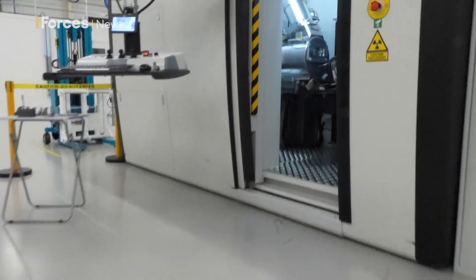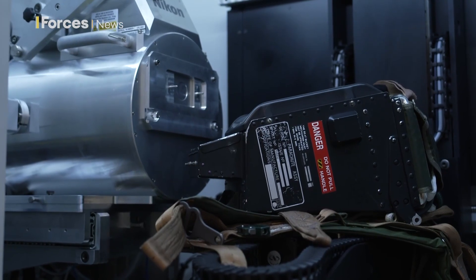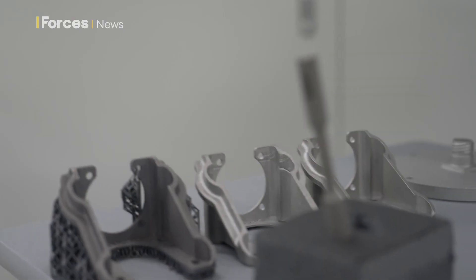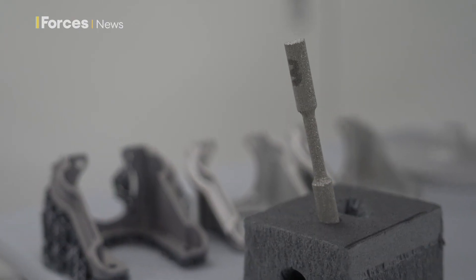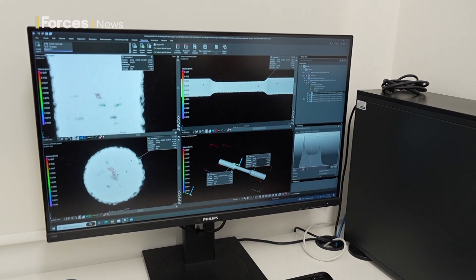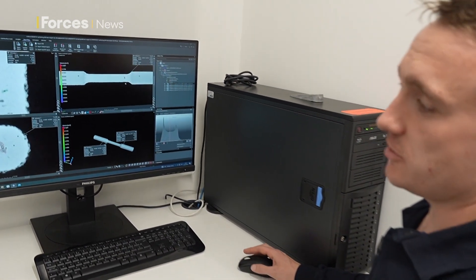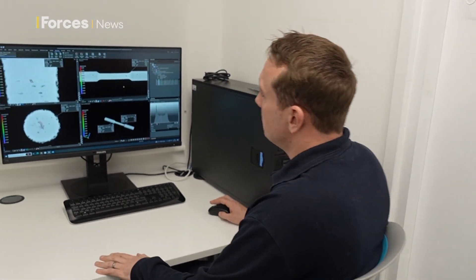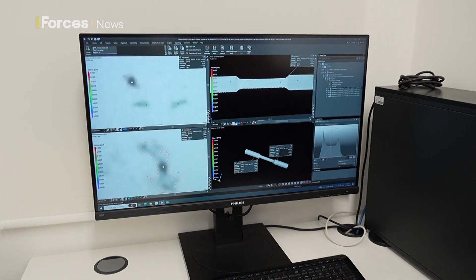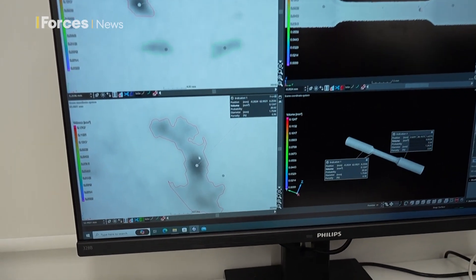This is the starting point. The people qualified to use this machine originally qualified in the 2D radiography method, and then progressed on to the 3D computer tomography method. In the background, a 35-page document has been prepared on the dog bone that was scanned earlier. There is a fair amount of porosity within this test coupon, which obviously isn't good — we want them to be perfectly solid. To summarise, this component needs more work. The porosity means it has too many air gaps in the metal, making it not structurally sound.